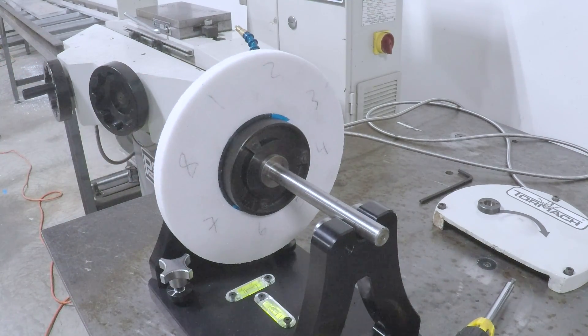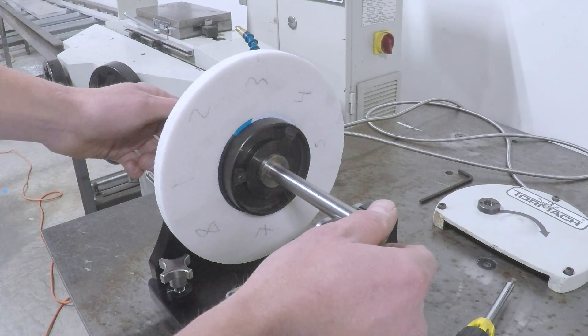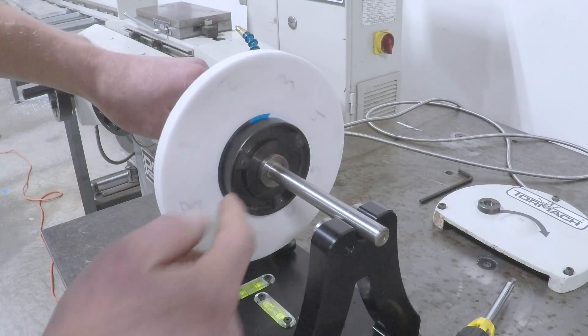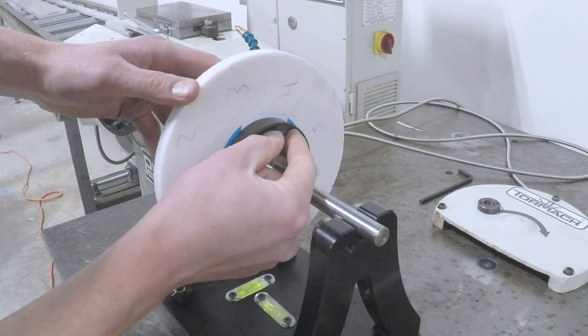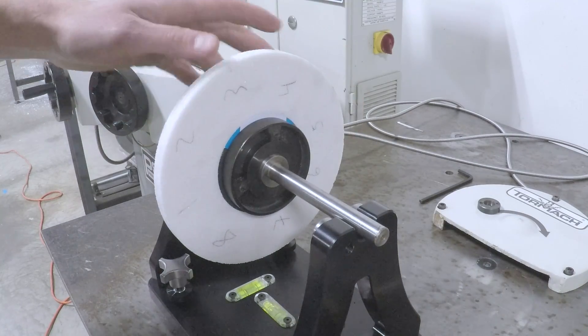With two up, it's moving toward five being heavy. Put it at three — if five is heavy it'll move even more deliberately, and sure enough we can see it. So we've got to get some weight away from five. I think I went the wrong way — we should go from four back toward three. But that's what makes it so easy: when you've got all the numbers on here, it's less frustrating and there's less chasing your tail.